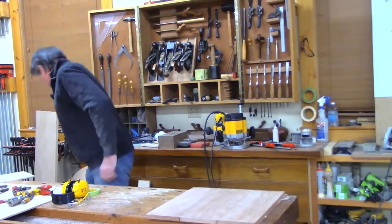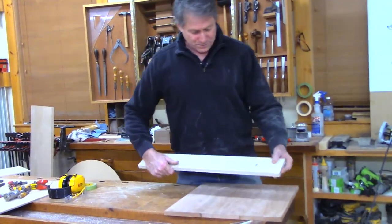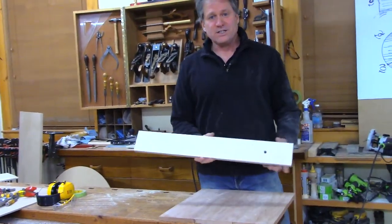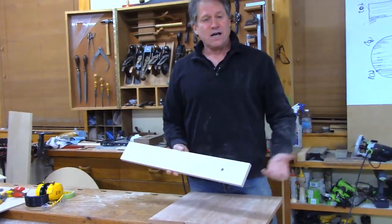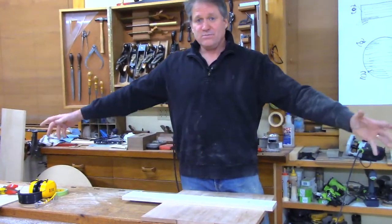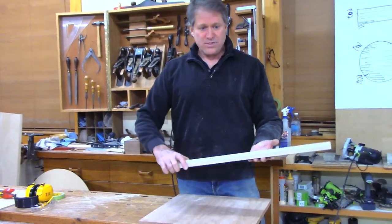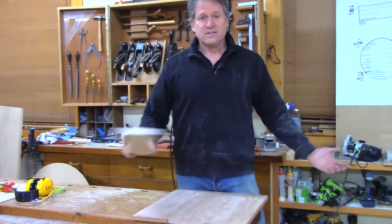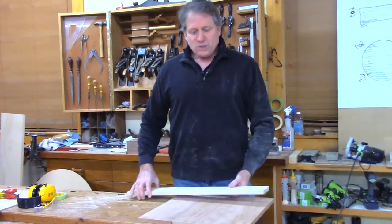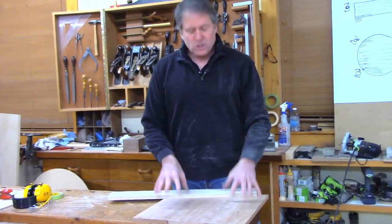And I'm going to show you my quick and dirty circle jig. So this is your circle jig. This is all you need. It's just a piece of plywood or MDF. I commonly use 3/4 MDF. And I've made long ones of these where you're pulling radiuses that are 4 feet. So you're getting a 4-foot radius, which would make an 8-foot circle. But regardless, we just want a little, like a 17 and a half-ish top here.